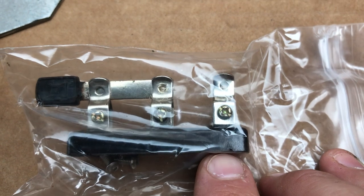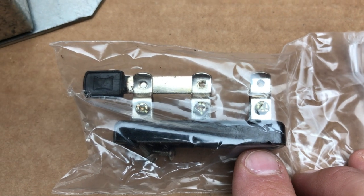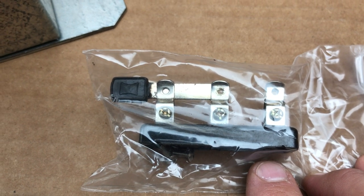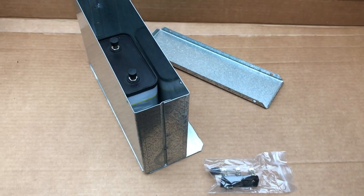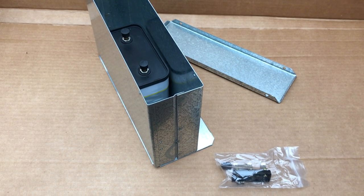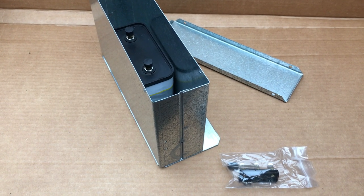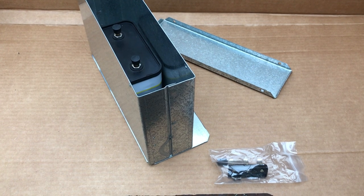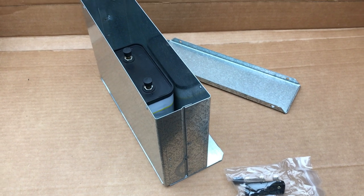As you can see, the size of these lugs on the knife switch means you will have to create some wiring harnesses of your own to make your connections between your magneto post, your coil box, and your battery. The purpose of the box on my tractor is simply that I have lost faith in starting on the magneto without getting injured. I've decided to use this period accessory to start on a battery and then switch over to magneto, just to make safer starts.